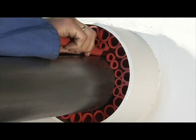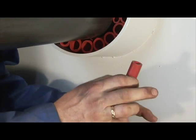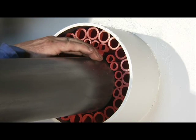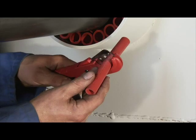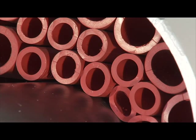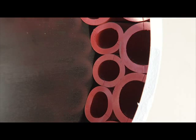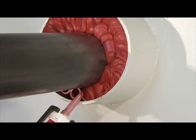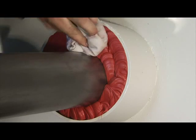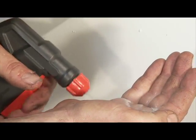After having finished the front side of the penetration, the remaining openings around the pipe at the back caused by the angled ducting are filled with Norferno filler sleeves which are cut to length. In the case of angled penetrations, a final check on the filling on this side has to be done as well. The remaining part of the conduit can now be sealed by applying the sealant. After application, the sealant layer is pressed down and smoothed.